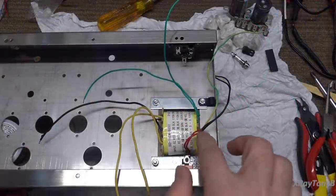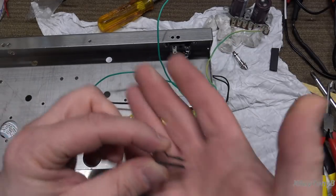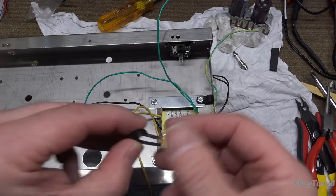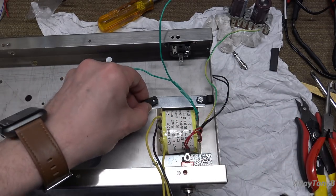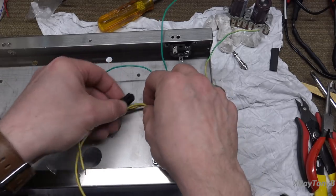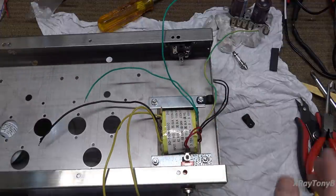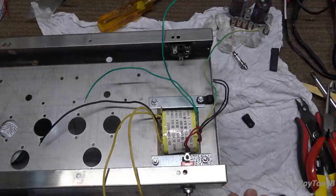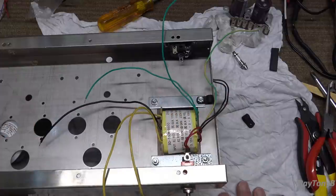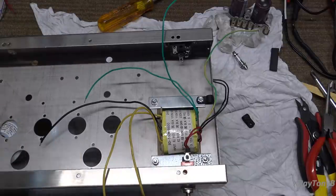Now that we have this connected, I removed the nut and put one of these little plastic wire clamps — you can buy these online very cheaply. I'm also going to put one right here just to hold down the filament wires, and then we're going to run the filament chain through these. As I said, I'm not going to use the circuit board; we are going to use point-to-point wiring technique on this amplifier. I much prefer it for this type of design.